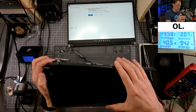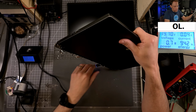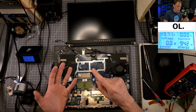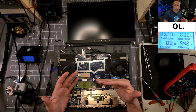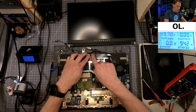But this does verify a few different things. So let's talk about that. So by testing with our test screen, we confirmed that all the fuses work, that the VDD on the LCD is working. It was getting a 2.7 error, which means it wasn't able to detect the LCD screen, which is usually on the VDD circuit. So that is actually being detected fine with this one.